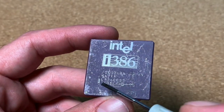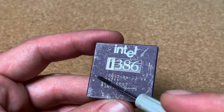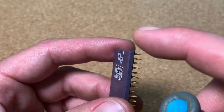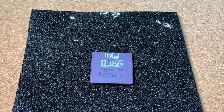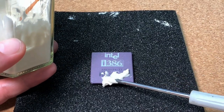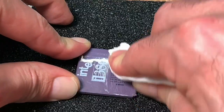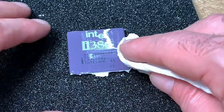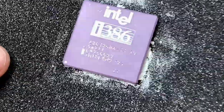Now let's put the focus on the ugly scratches on the ceramic. I was wondering how ceramic can get scratched, since it's harder than any metal. With my microscope I found out it's just dirt — with a metal you are writing on the ceramic like with a pencil on paper. I found a nice polish paste made of Paris white which works great for all ceramic chips. Just put a bit on the surface and take a tissue to rub the scratches away. You need to press strongly, and to avoid any further bent pins I stuck the CPU into a form. You just need to take care about white printings — the polish paste would also remove them if you go too much over it. The black markings you don't need to worry about; they are laser engraved.